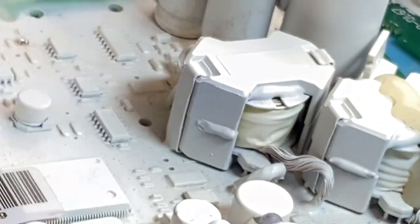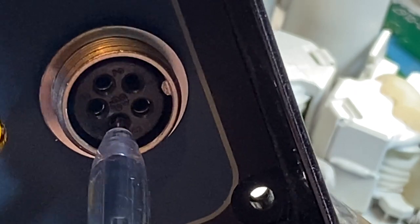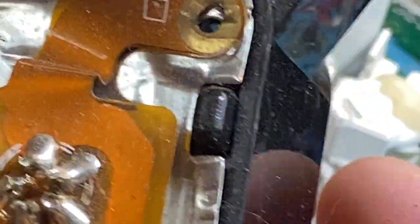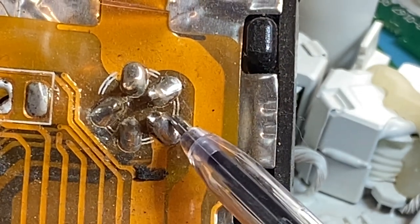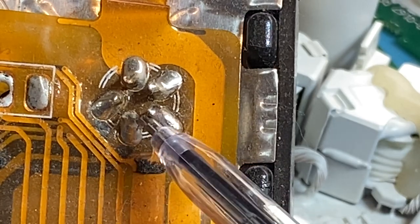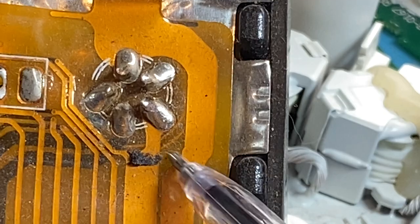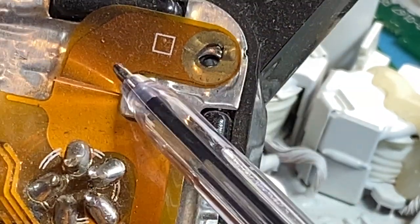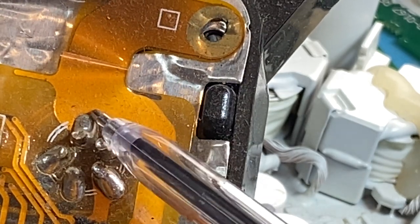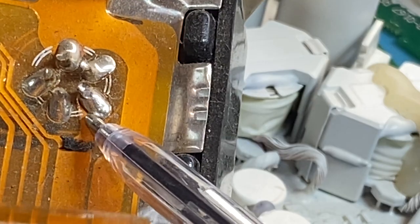First of all, on the connector, if the plastic body, I mean, not the internal part, is loose and you're pushing your connector in or out, and it starts flexing the pins in relation, like one pin will flex or a whole lot will flex, it breaks the connection. It's very hard to see, but it breaks right next to the solder joint on the mylar. Under that mylar, these tracks are all very, very thin copper. As you can see, that's an earth point, ground point there, thin copper. And it goes to negative input there. And this one here is your positive input. So if these things are wobbled, it will crack. It's very hard to spot.